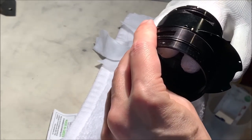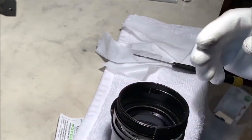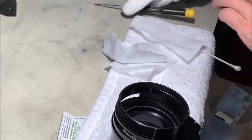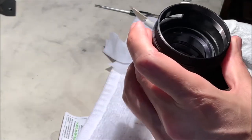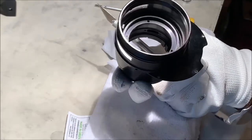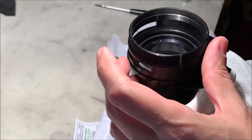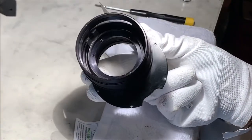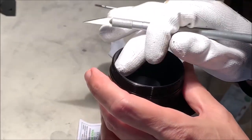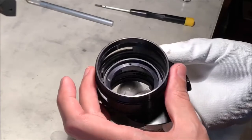And there it does - I'm going to hold that position, go a little past, that's okay, and then make a mark. The tip of a screw in there is almost nicely aligned with the center of the filter slot. I think that's all I need to know - this is going to be a single start. I'll be amazed if it's a two-start. So we're just going to do a test run, then it goes back in that way.